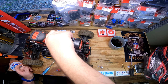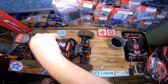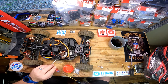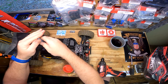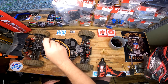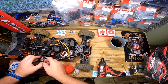It'll work its way up if it needs to. Also, like I always say, if you're going to use one of these drills, I almost never use this to tighten. Fatal mistake right here - always double-check your clutch setting. Now finish this off by hand. Let the drill do the bulk of the work, but if you're going into plastic - no. If you're screwing into metal, it's fine to run it to the clutch, but if you're going into plastic, no.